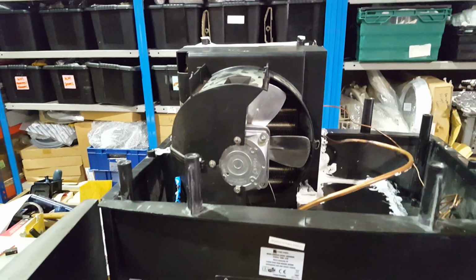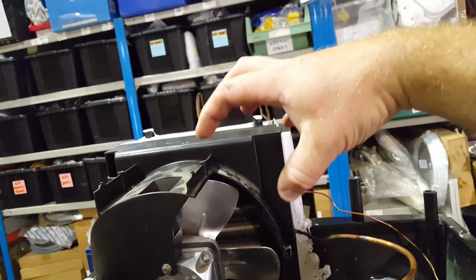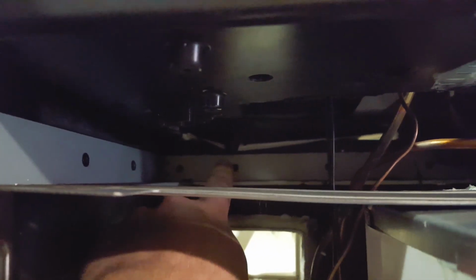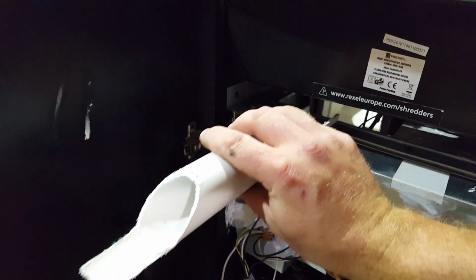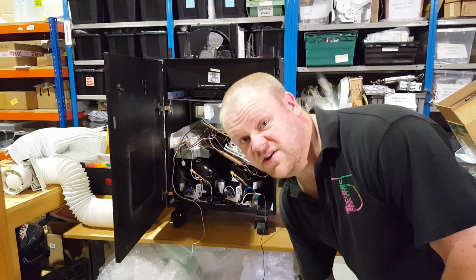When the evaporator gets cool, it naturally acts like a dehumidifier. So this is actually from a dehumidifier. That's half the reason I use this, because it's also got a water gully at the bottom, which goes into that nipple here, right at the back. See that? My fingertips on it. Hard to see on the video. So the water can drip onto there, go through the pipe, and I'm going to curl this round, and that's actually going to go through there, sit there like that, and get attached to that. Awesome. All I've got to do now is gas it up.